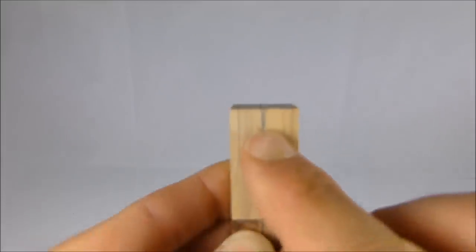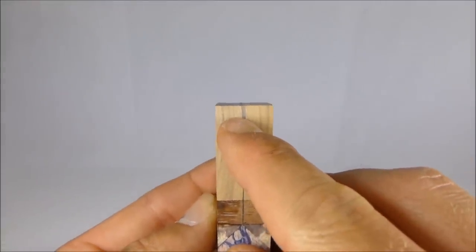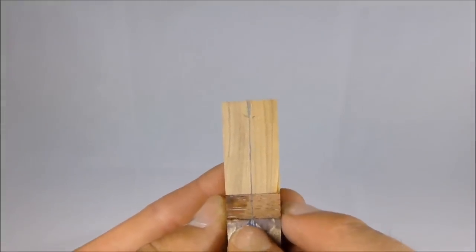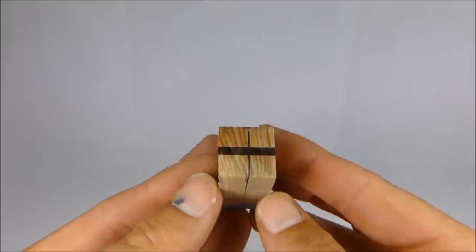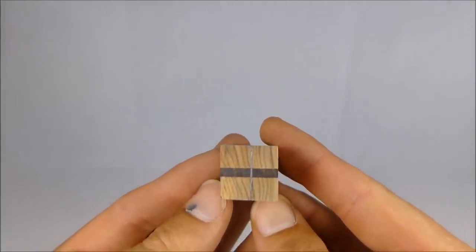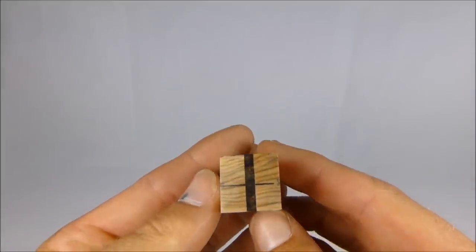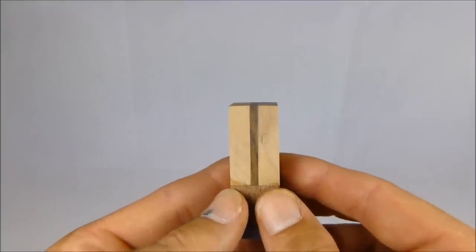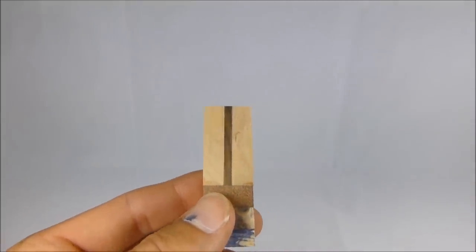Before I drill it, I've miked the end and put center marks — that's dead center — then drew a line from tip to end on both sides and bisected the cocobolo stripe. I'm hoping I can put this in the vise, keep that stripe perfectly vertical, and put the bit right there. I don't have high hopes — this material is hard. If you've got advice, holler.